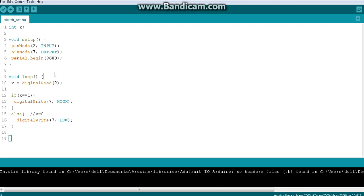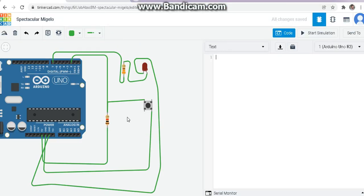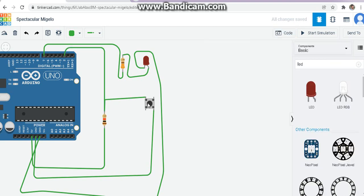We have been looking into the pull-up scenario where the initial state of a pin is plus 5V, and when you push the button the state goes to ground. This is how the circuit looks in the simulation environment. Think about this resistor connected to plus 5V going to pin number two, the input pin. Since no current is running, plus 5V will be the pin's value — that means high, or one.